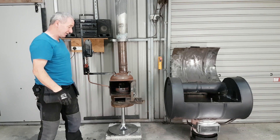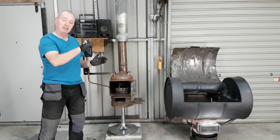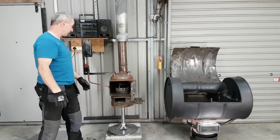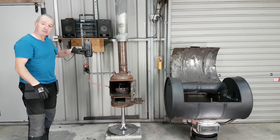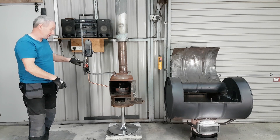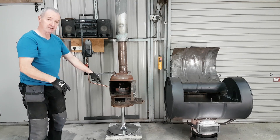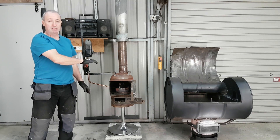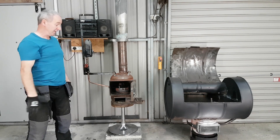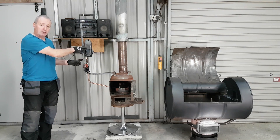That's it — it took about 2 seconds to get it in there. So if I put oil in there and give it a bit of kerosene to get the chamber red hot first, the more oil that goes into it, it vaporises and that vapour can then burn — that's the principle behind it. I've got some used motor oil in this little container — that's just a milk carton. I put a tank connector into it, a bit of half-inch pipe, a half-inch gate valve, and a piece of half-inch pipe down into the system. This stove is going back to its original owner — he's going to come and collect it tomorrow, so this is the last chance I get to convert something easily to oil. This took only a few minutes to do the conversion because I've already made up the waste oil system.